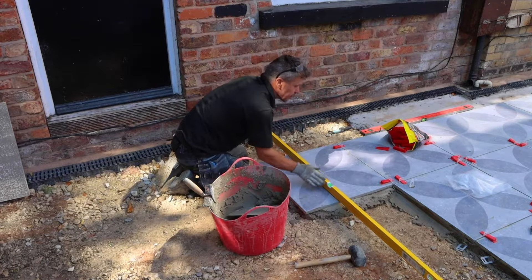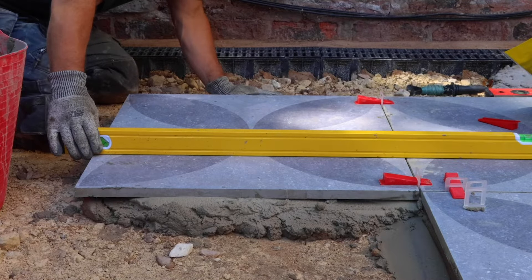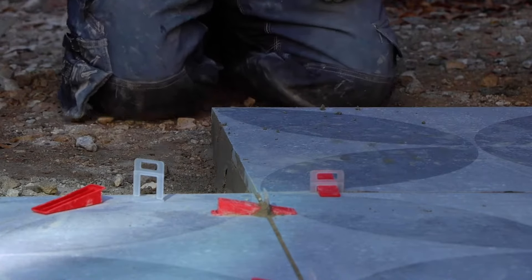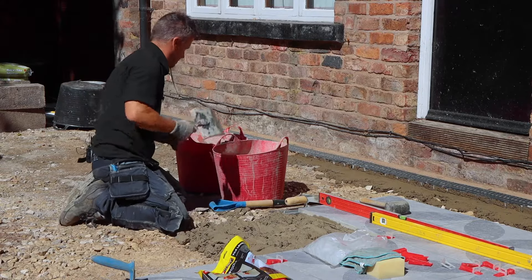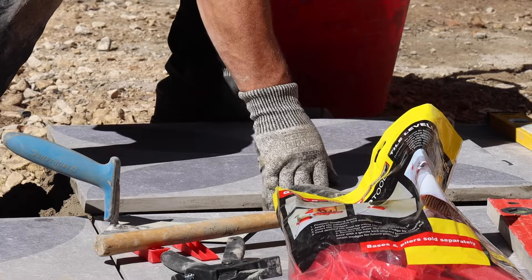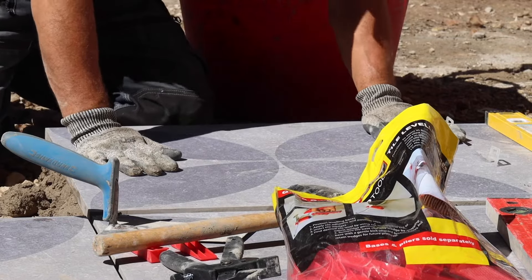It's a little bit harder to do — sloping down and then level across this side. Then I use my pointing trowel to compact the mortar from the under edge of the slab. Now our hardcore sub-base is about 150mm in depth and this is heavily compacted down with a wacker plate. If you're laying porcelain slabs like these, we'd recommend about 50mm depth of rock-tight mortar.